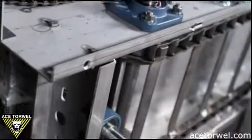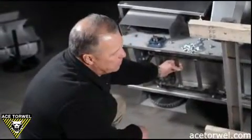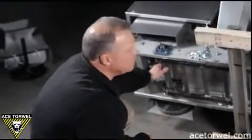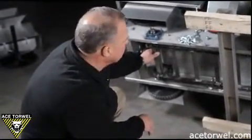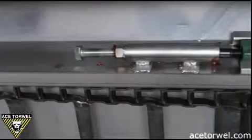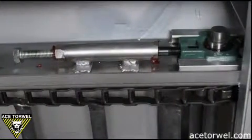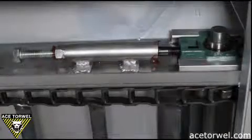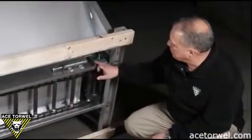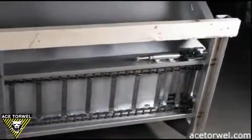To the shaft, we add two eight inch cast iron 82 sprockets, and then the self-cleaning pintle chain that gets attached to the front and rear of the conveyor system. It runs up through the hopper and delivers the sand out the back of the hopper. On a one inch shaft, we have two take-up bearings adjusted automatically through a system that is unique to Torwell. We weld a stainless tube to the body of the unit and include inside this tube a couple of rivets and a spring, which keeps constant tension on the bearing, keeping force on the front of the chain, which always keeps the conveyor chain taut.